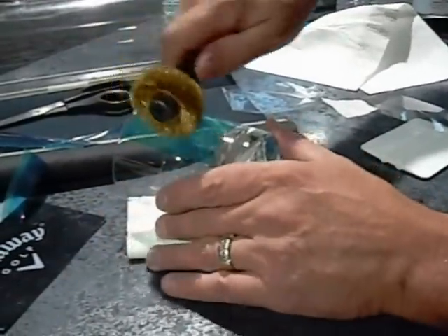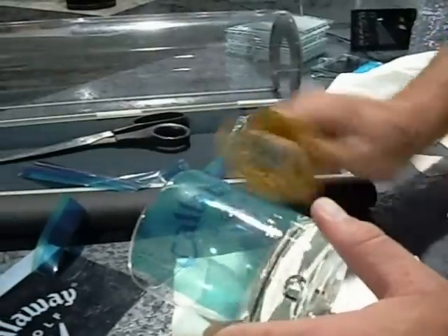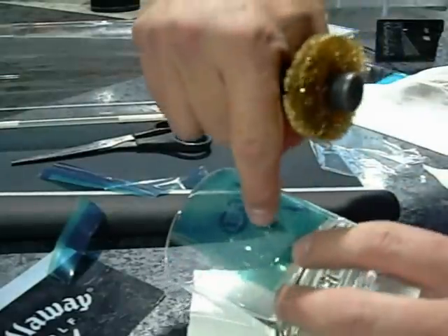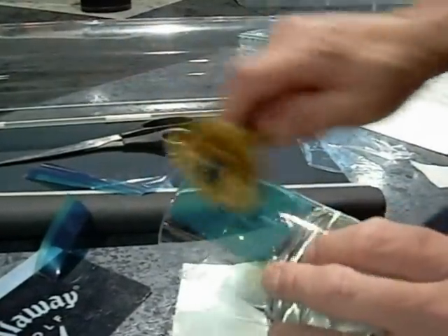Some people like to use a wire wheel. If there's any air bubbles, it'll pop any little air bubbles. What does an air bubble do if it's caught in? If it's too big and you sandblast over it, it can burst it. And then, let's say the bubble was here — it'll etch that area. And we don't want to etch that area.